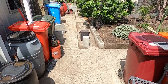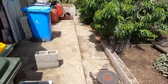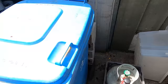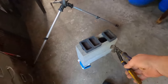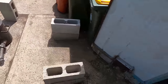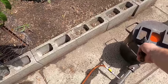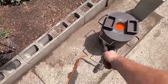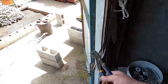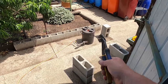So yeah, all right, a couple of minutes and I'm going to start pouring. Oh, actually, I forgot all about it. What I want to do is put these molds on top of the furnace, start them off on the sides, and just let them heat up a little bit. Then once they've heated up, I put them towards the middle where it's most hot. But for now, just let them heat up. You don't want them to get super hot straight away, going from cold to 1200 degrees Celsius. So give them a couple of minutes like that and then move them over.